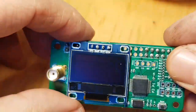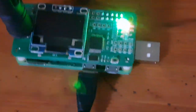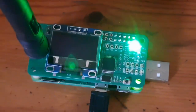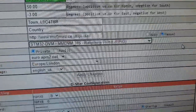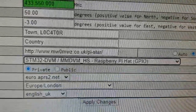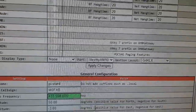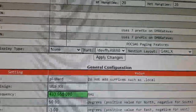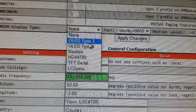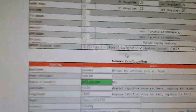Next thing — let's see if it actually boots up. We've plugged it in, it's all booted up, and now we're going to go into Pi-Star and tell it to use the OLED screen. So far all looks fine. Here's Pi-Star — we're going to go into configuration. You need to make sure the correct hat is selected. Obviously get your call sign in and things like that. Up here in the screen section, select where it says none, select OLED — I'll go for type 3. I'm not actually sure what the other ones are. Then click apply.